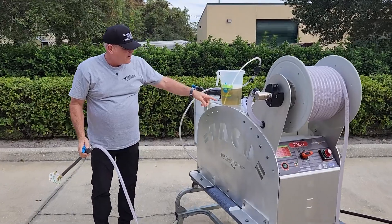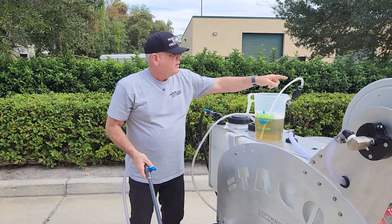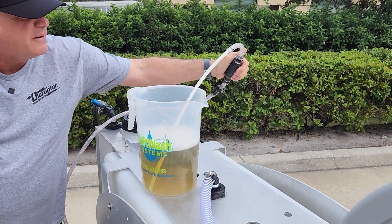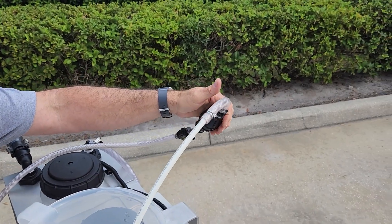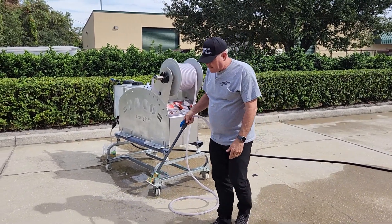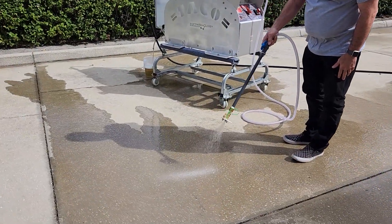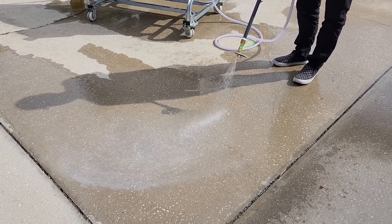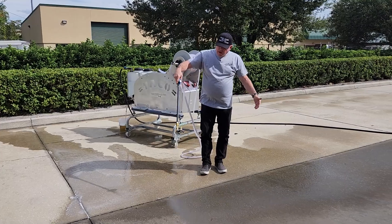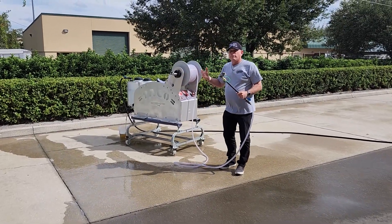When you open up the valve, you'll see it start to draw soap up into the hose. I've got my bleach set on three, and my stinger in place. I'll turn on the hose and start to prime it. The pump may cavitate for a moment as it pulls some air from the stinger. Once soap is primed into the stinger, it works its way through the 150 feet of hose, and you'll see the soap start to come out through the wand. There you can see Soft Wash Systems Green Wash coming through. Now you've got bleach, water, and surfactant in your hose — that's how easy it is to prime your surfactant into this machine.